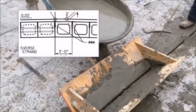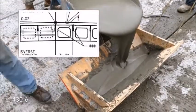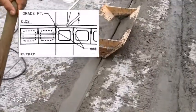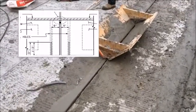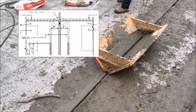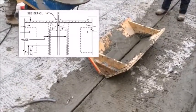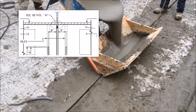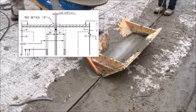It is important when grouting on crown-typical sections to grout the center shear keys before post-tensioning. In order to allow for the correct expansion in the spans, be aware of fixed ends and expansion ends when grouting your dowel holes. Dowel holes at fixed ends should be filled completely with grout. But for expansion ends, dowel holes should be filled with approved joint sealer to one half an inch above the dowels and then topped off with grout.